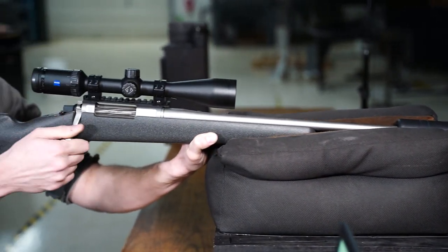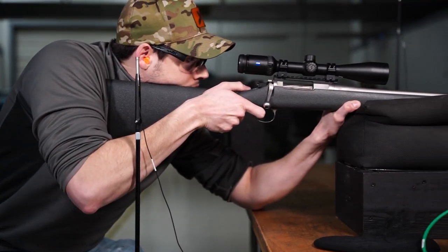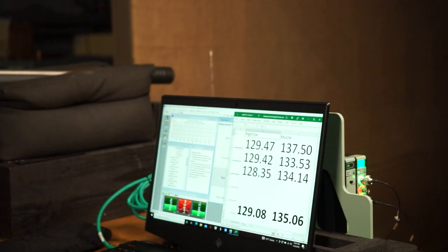There are so many factors that can affect peak dB, such as the reflective surfaces near the measuring device, environmental factors such as temperature, humidity, and elevation. Of course, all the different hosts we can put our suppressors on, the cartridges they're chambered in, and even each individual specific load can affect that measurement. So because of all these ever-changing variables, we don't find assigning a rating to a specific suppressor based on peak dB to be very useful, but we will show you testing data in context.